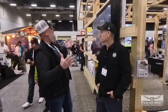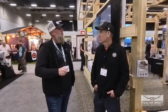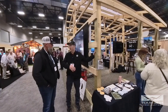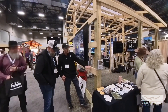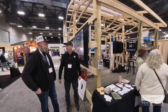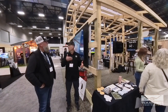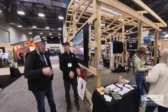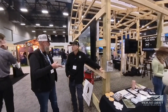You've got a little display here showing the simplistic design of what you do routinely. Can you give me a breakdown? Typically we use three-ply or four-ply columns depending on sidewall heights. We have two-by-12 grade board, then two-by-six girts two feet on center all the way up, and trusses eight feet on center. With an eight-foot span we can run two-by-four purlins two feet on center on edge. If you drop to four-foot-on-center trusses you have to run headers to carry them.